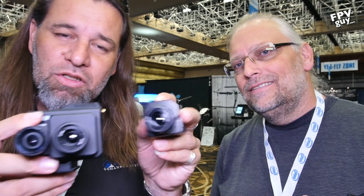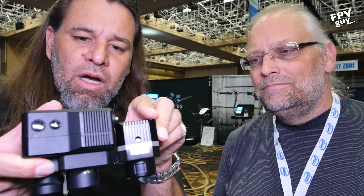The form factor was originally designed to be a GoPro form factor — a great idea, probably if we'd done it two years ago. But after listening to the market, FLIR made some choices, did some new engineering, and we're really excited about the new Duo Pro R. This is not GoPro size. It uses the same Tau 2 core, and we have an additional 12-megapixel camera on the side — it's not just an FPV camera, it's a high-res camera. It does full 1080p and I think even 4K.